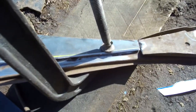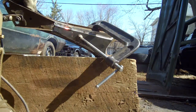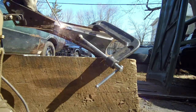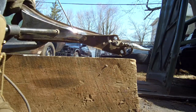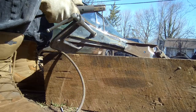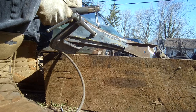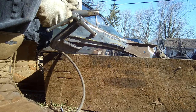I set up the welder and started to weld. Now I have an issue with the welder — I always have this issue when welding at home dealing with 120V. The circuit breaker always trips out when the weld is really rocking. I have to go off and on so the breaker doesn't kill the machine. I've actually learned to weld like this with the stick welder. It's a bad thing, but also a good thing — mostly a bad thing.